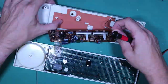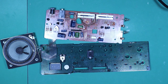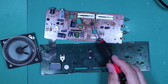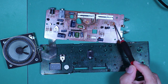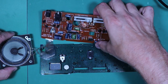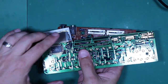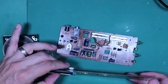At this point I decided to separate the electronics from the plastics in order to give myself more room when trying to diagnose the problem with the VL1. A couple of things struck me as interesting when I started to look around the board. The first thing is that these two capacitors here seem to have suffered some kind of trauma — they're covered in some kind of white deposit and there's white deposit on the board too. Also there is some solder from one connector that's bridging two tracks, so we're definitely going to clean that up.